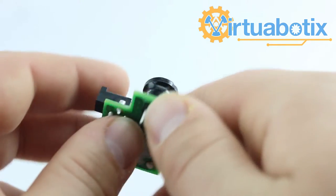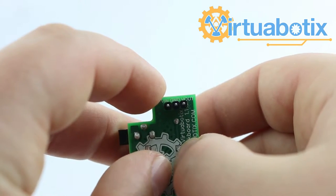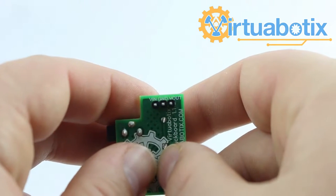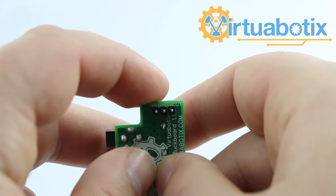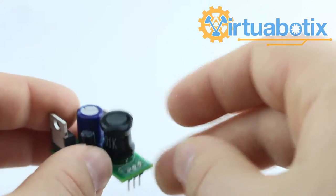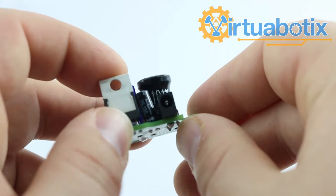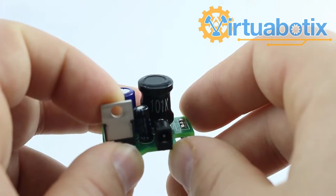On the 1.1 version, we added indicators for what the output is, since some TO220s don't have the same pinout. This is the most standard one I was able to find. You have raw voltage in, ground, and V out — this just plugs in and you can solder it in. The nice thing is you have a power plug that you can plug any of the Versalino power adapters into to give your project instant regulated power.